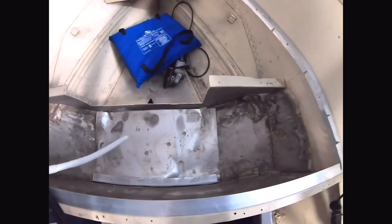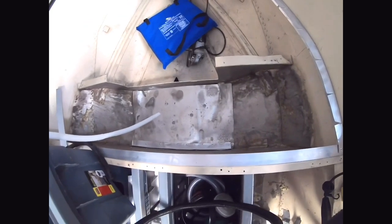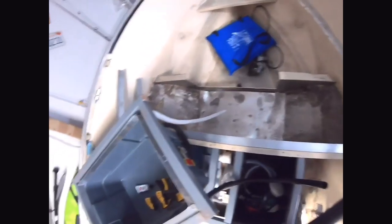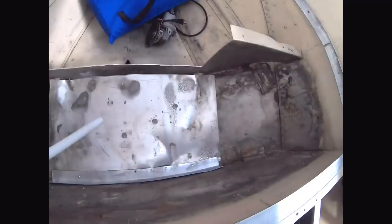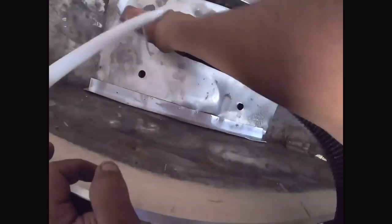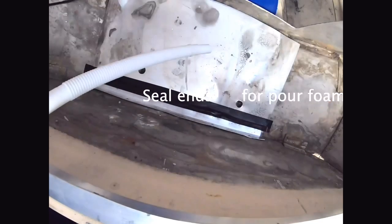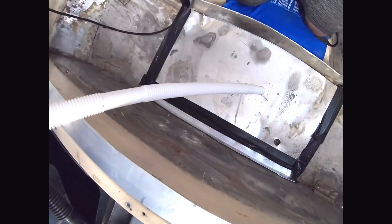To pull this whole thing off we have to make some modifications to the front wall. We cut it out so the tote would fit but kept the sides because they're useful for trapping foam when we pour it in, and also to run the rod locker tubes to the right side. There's a subfloor we're going to have to seal off so foam doesn't seep into it. We'll draw the holes for the tubes to go in, seal those tubes in, so when we pour the foam none of it will go down there and collect, rot, and saturate with water ever again.